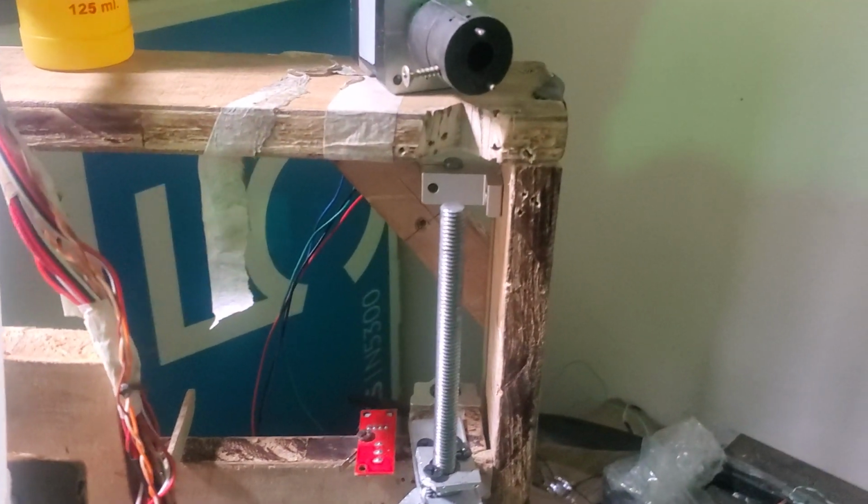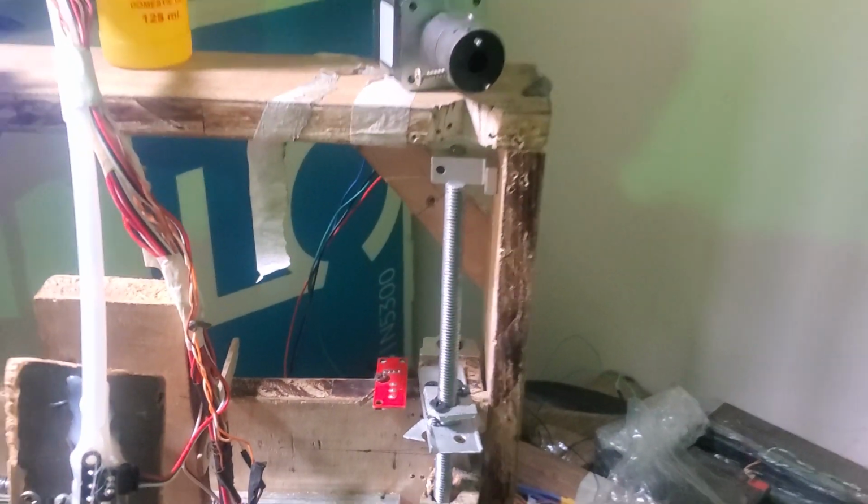There will be M8s, but 1 millimeter pitch. Okay, not okay. These are M10s. This is M10. But I found some M8s, threaded with a better lathe because they are for sale. So the threads will be of better quality, but same pitch. But obviously, with this pitch, it's tricky to move it for the NEMA. It's slightly taxing. That's why people usually use the Acme threads, the 2mm pitch, plus they are trapezoidal shaped. So chances of getting stuck are minimal.